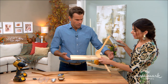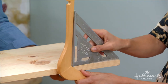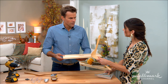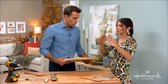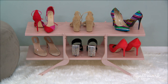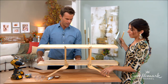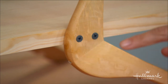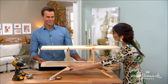At that point it's in place but adjustable. Will you hold that up one more time? This is how we're going to get it squared. If you angle it so that it's perpendicular — if you've got a square at home or even just an L-ruler — line it up evenly. That's what's going to give you the support. Once it's lined up, mark it, pre-drill it, and put those screws in. That's where the second screw goes for maximum support. You can see here there are the two screws — the first one to adjust it, lined up to the bottom, and then we're perfectly perpendicular. We put two in there and two in there for our bottom shelf.